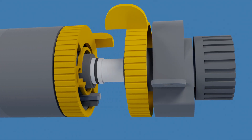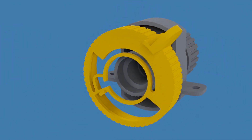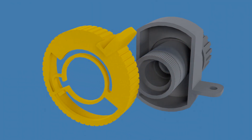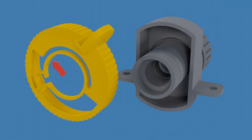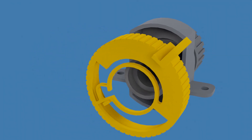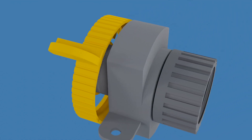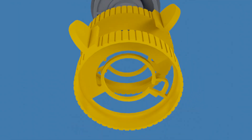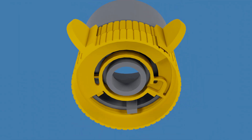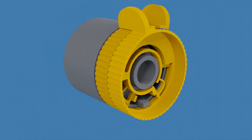The second mechanism alternately changes the direction of rotation of the hydraulic wheel. The sliding tabs are mounted on the fixed sub-assembly by means of a rotary detent mechanism. It consists of a set of teeth on the tab's body and a corresponding series of notches on the sprinkler's body. When you adjust the tabs, the notches engage with the corresponding teeth at different positions. This engagement creates a slight resistance that holds each tab in place until sufficient force is applied to move them. The tab body has a slot through which a stop mounted on the oscillating sub-assembly travels. By moving the tabs, we can reduce or increase the slot length and therefore adjust the travel of the oscillating sub-assembly.